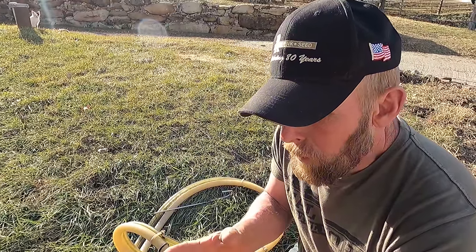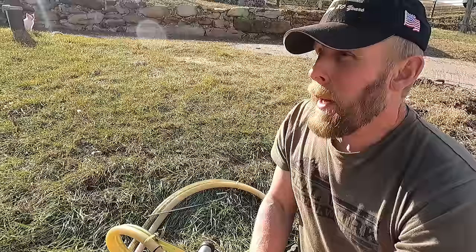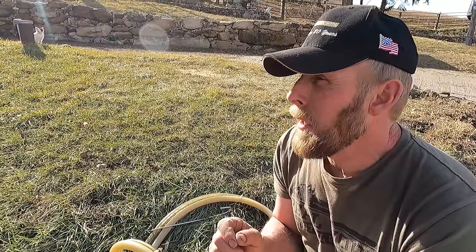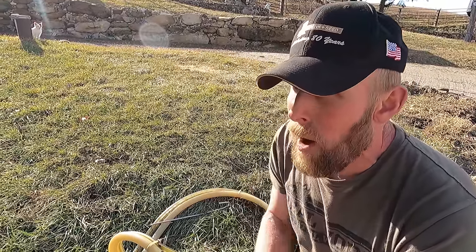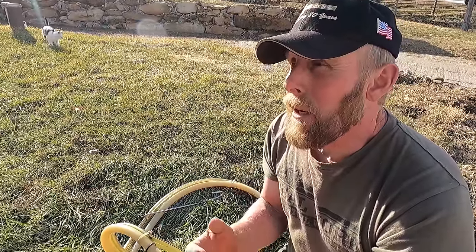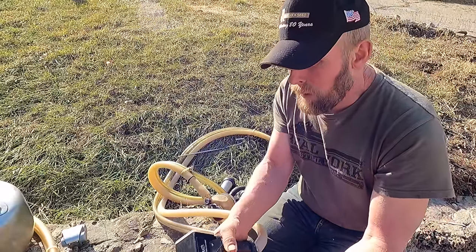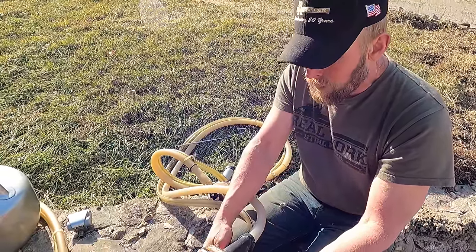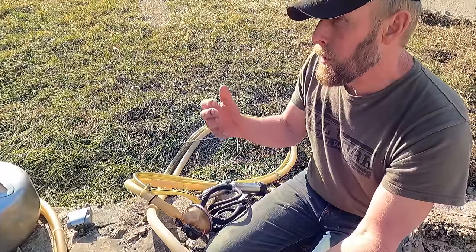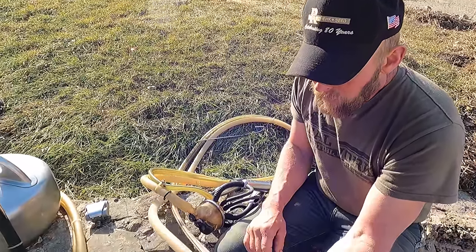There can be beepers too, which can get a little irritating when you've got six going at one time, but it just helps you be better at milking your cows. The theory is: get the milker under the cow, get her milked out as quickly as possible with the least irritation, and when she's done get that unit off. You want to train your cows to let down their milk, because when milk stops flowing it becomes extremely irritating for the machine to keep tugging away. You can train cows to let down fast or you can inadvertently train them to hold it — what they call over-milking — and that hurts milk quality.